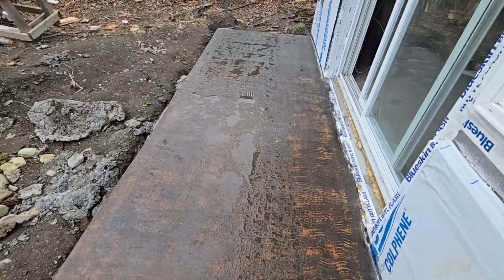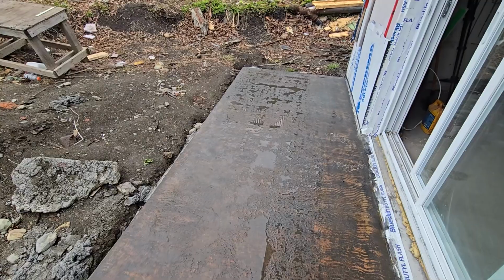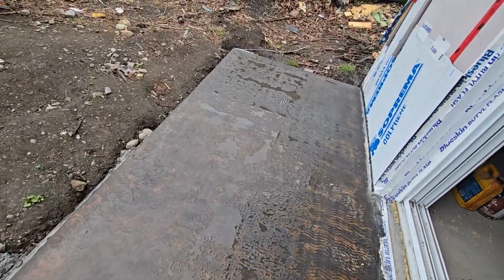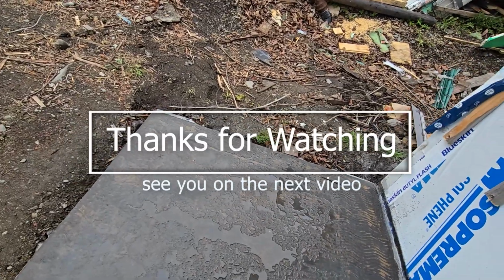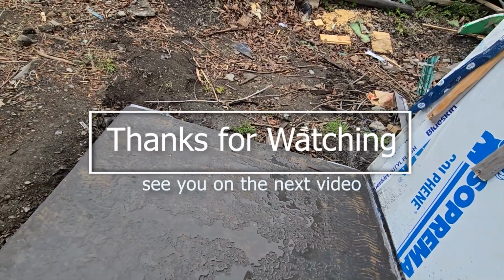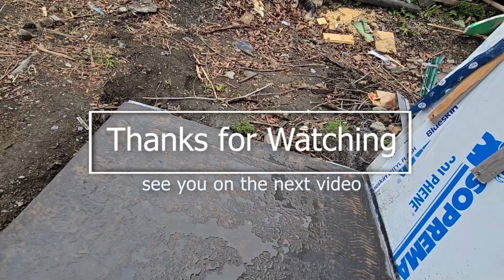I mean, it might be a little hard to see on the camera. There's a bit of a bird bath action there because of the way it's pooling up. Maybe I should have gone a little more. I went a quarter inch on 6 feet. Or 5 feet, pardon me, 60 inches.